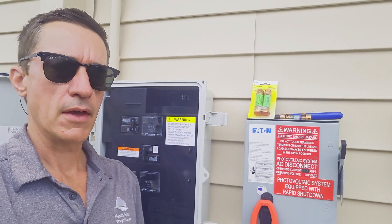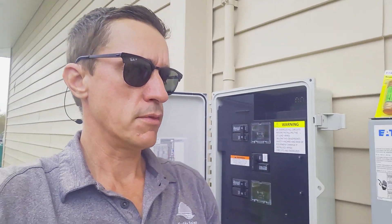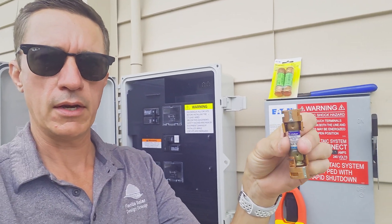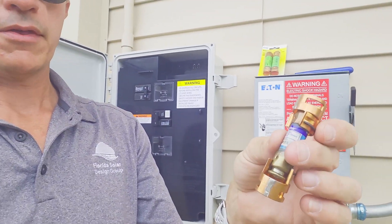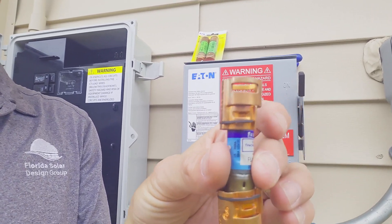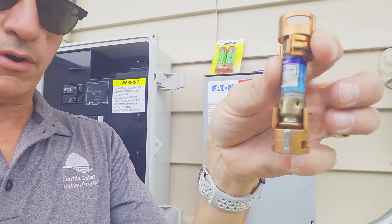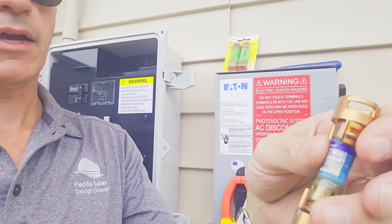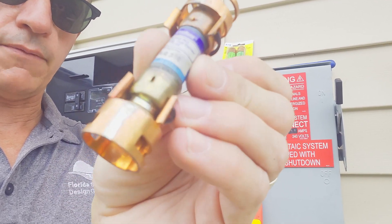It sounds like a simple thing, but obviously you've got to figure out why the fuse is blowing and what the source of that is. It turns out they used 30 amp fuses, which was appropriate for this installation, but they used a fuse reducer and a 60 amp fusible disconnect to get down to a 30 amp fuse. The problem was they used a rejection type reducer on both ends instead of just one end, so they obviously didn't know what they were doing, and it looks like this bottom part is completely loose, if you can see it. So it was arcing and heating up, and eventually this fuse blew, and you can see it's a little bit discolored — the copper on the end of the fuse is all discolored.